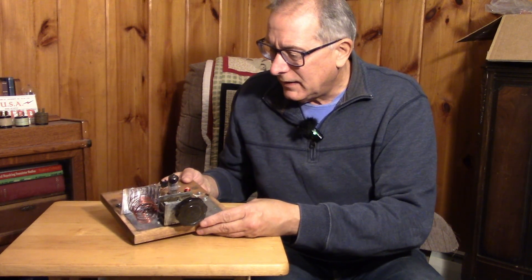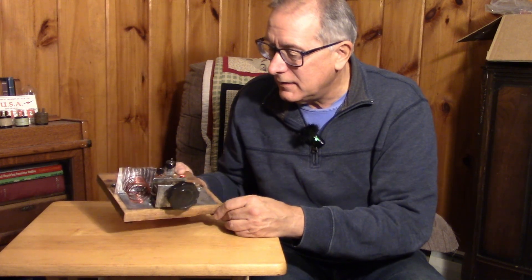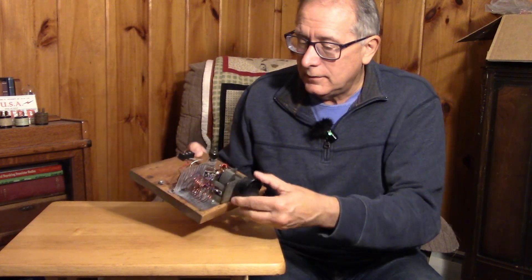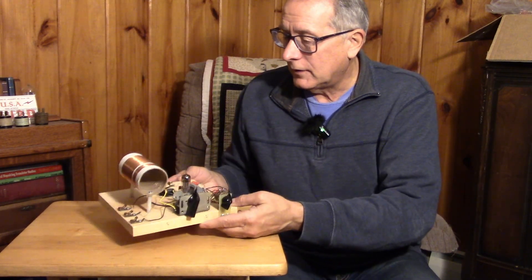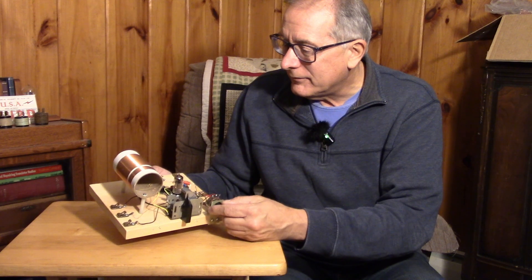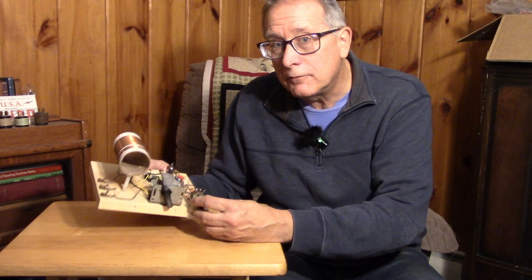This is cute — I see a dual tube. My guess is this is some kind of a preamp for shortwave, probably a cascode amplifier for shortwave to put on the front of your shortwave receiver to pep it up. Nice capacitor to recover here. This looks like a broadcast band receiver with a battery tube — I think this is just a straight grid-leak detector, or maybe a regenerative preamp.